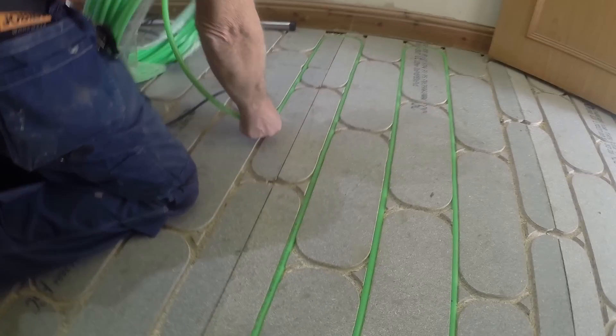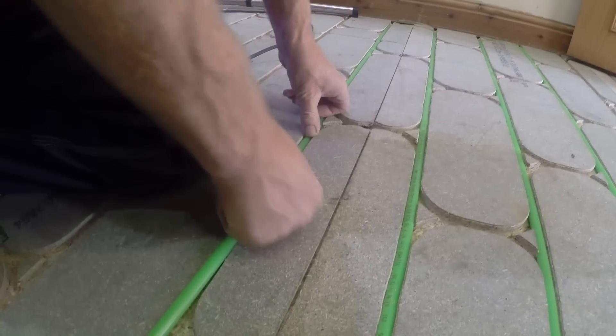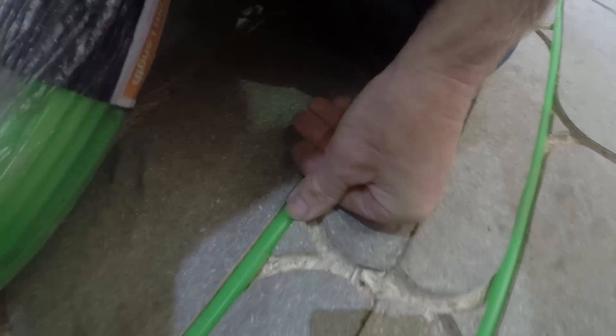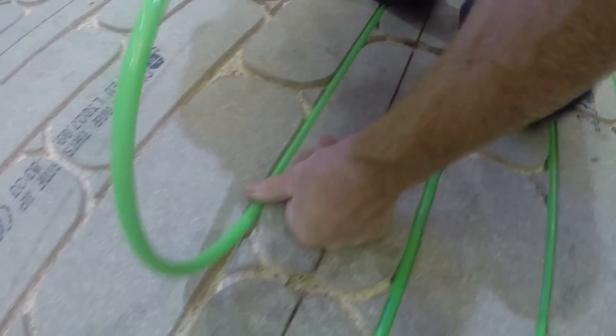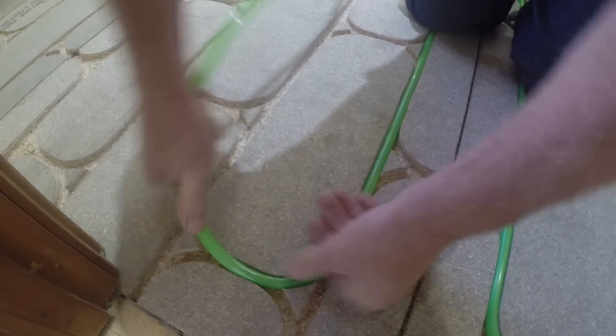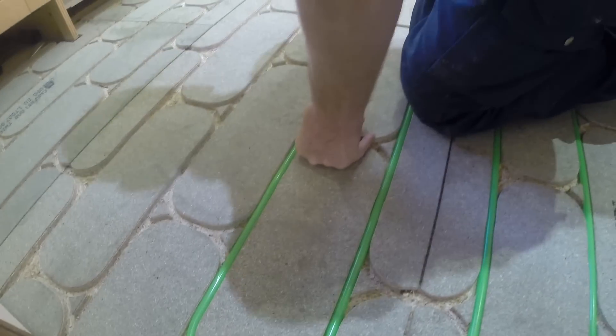You must make sure that the tongue and groove chipboards are actually meeting on a joist. Some builders I know had boards meeting lengthways mid-span, which is not a great idea. They got away with it because they had good Celotex underneath, well supported, and then fairly thick engineered oak going over the top, so the weight was spread fairly evenly. But if you're doing something like tiles, don't whatever you do join those boards between two joists — make sure the end of the board lands on a joist, or put noggins in to support just at that position, which is another good option.